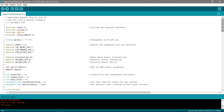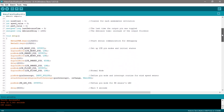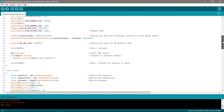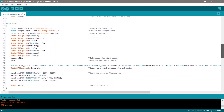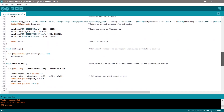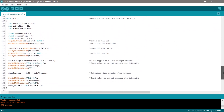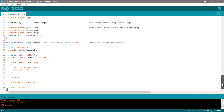I've created a sketch using two example sets of code: one being the 4G example code that MakerFabs have put together for the Madduino 4G, and the other being the original code for the Open Wind Station. This has the calculations and settings for the sensors, although I suspect they may need to be recalibrated, as the change in cycle time will affect the wind speed calculation and the lower voltage probably affects the brightness of the air quality sensor's LED and its analog output.